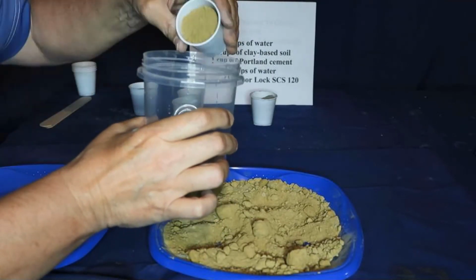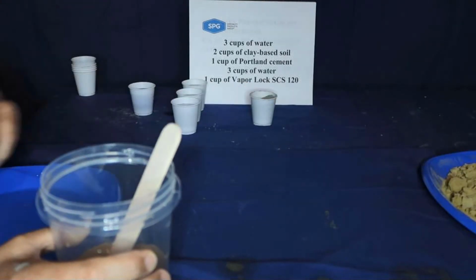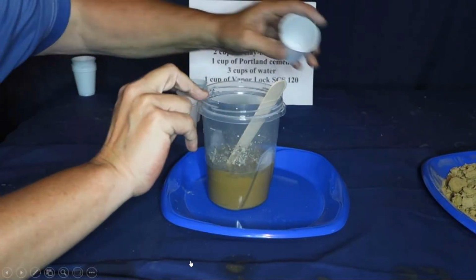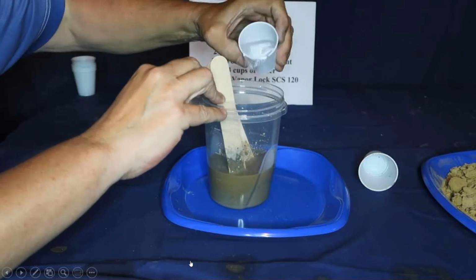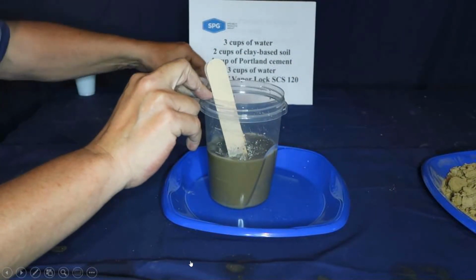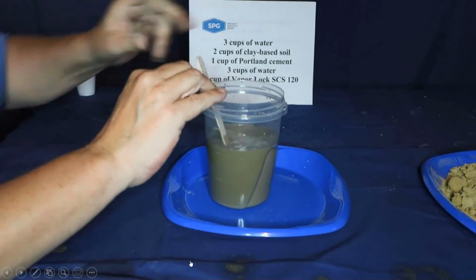Cement modified soil got started back in 1935 and has remained relatively unchanged in 85 years. Even today, the process remains the same. You have a geotechnical company drill samples around your site and determine its contents, including clay, sand, and its PI. That's the plasticity index. They will then make a recommendation on the percentage of the weight of the yard of each test drill to make for the cementitious content to be spread on the surface of the soil, to be ground into the soil with the reclaimer. Typically, that number is 6% of the weight of that yard.